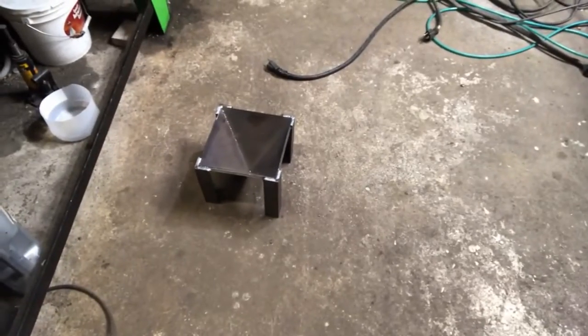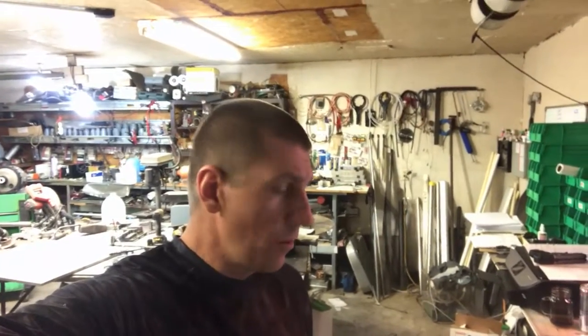We'll dump flux on the top, but we're going to have to dump flux on the bottom for sure — at least a layer about that thick — to start a little liquid pool for that material to sink into. The flux does not sink down into the material; the material's melting point is lowered by the solvent action of the molten borax. I'm having trouble staying awake — it's one of those 24-hour days. But we're not going to sleep: I've got a cone mold ready to roll and I'm going to fire up the second test right now and melt this stuff the right way.